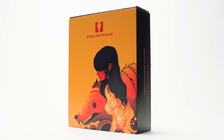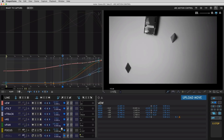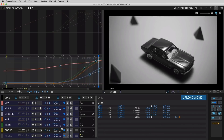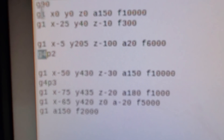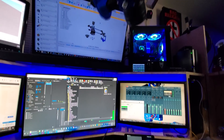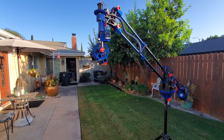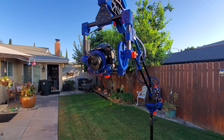There's plenty of software and hardware options that already do these exact things, and admittedly probably better, but they're expensive and proprietary. My solution was to use a basic Arduino and Raspberry Pi combination. The Arduino controls the motors like any other 3D printer, milling machine, or robot, and the Raspberry Pi is the middleman between you and where you want the camera. It's also Wi-Fi capable, so the entire rig is wireless.